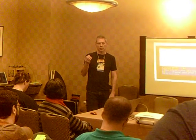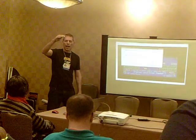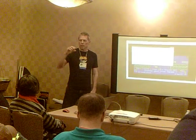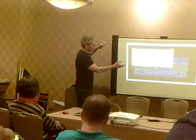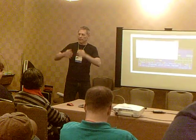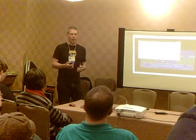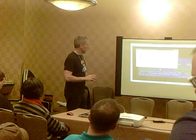Look up how big the VIA should be and how much copper you need in the traces. If you Google that, there's a table that says if you're drawing this many amps for this distance, you need this trace width. Be sure you look that up, because the design check and the electrical check don't really know what's going on in that circuit. They just know what's connected and how they're connected and how big you said the traces should be — they can't tell that a trace is going to take 10 amps. So you need to do that yourself.